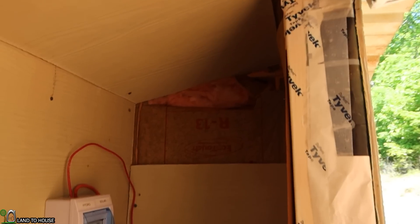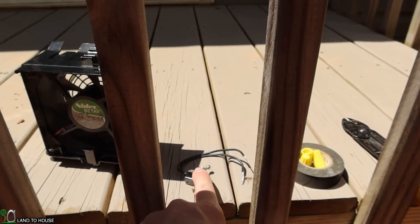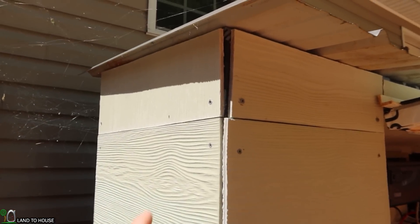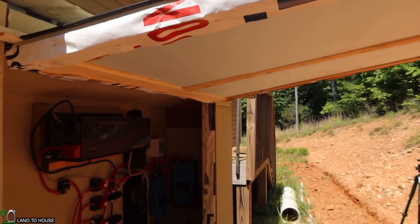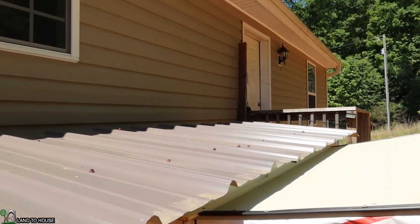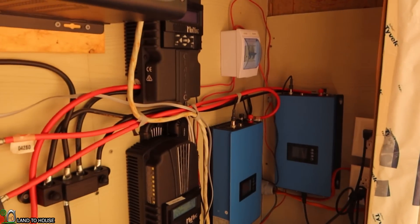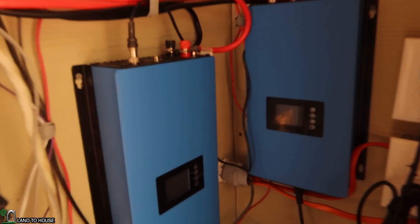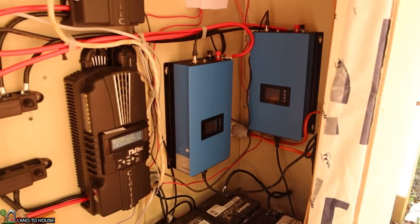The plan is to vent this little area. I'm going to put a small hole over here with some screen and then put one over here as well, and to get the air circulating I'm going to be using something interesting — a solar panel with a computer fan, and I've also got a switch. On the side of the building I'm going to put some window screen over the hole that I drill and then put the fan on the other side to pull air that way. Since it gets sun all summer long up top, it'll turn on when it needs it, and in the winter that won't get sun so it won't need airflow. If you're quiet you can hear all those cooling fans trying to run, so definitely have to have some ventilation in this little power shed.